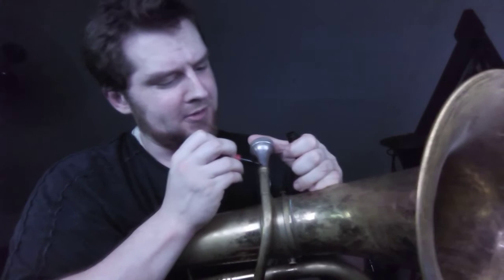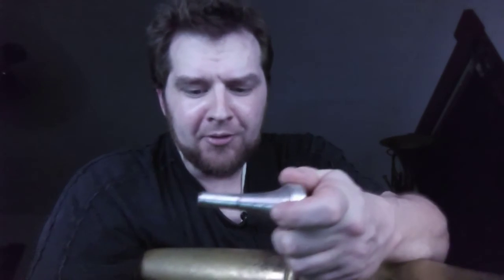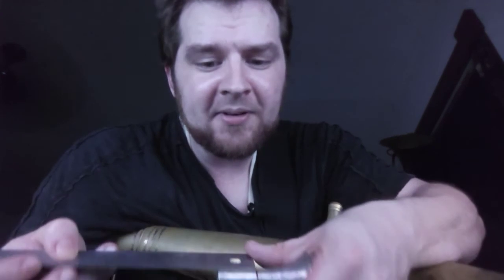The shank size on these is about 11 millimeter, and I'm pretty sure it's a 1-to-19 taper, not 1-to-20. You stick this in here — that's in there perfectly fine. We take the marker and mark this. That's a heck of an insertion depth — it's about 28 millimeters. Way too deep.